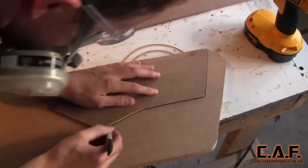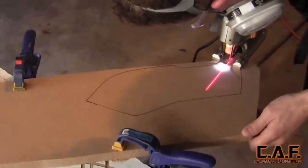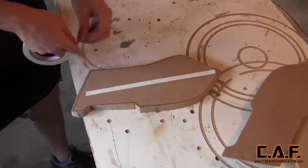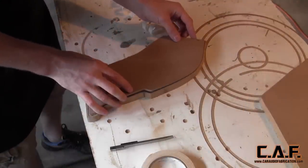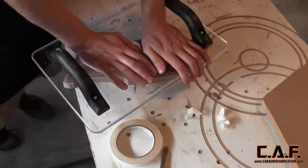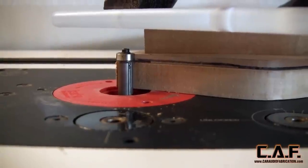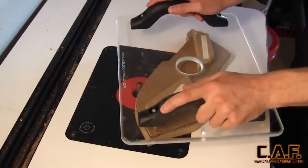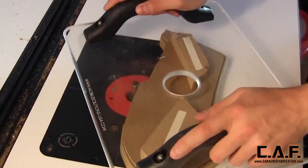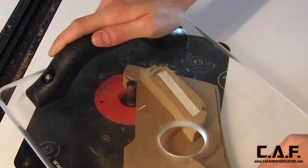I trace around what's left of the quarter inch shape onto a new piece of half inch thick material and rough cut this out as well. I then once again use double-sided template tape in order to stick my two pieces together. This time I'm also going to apply these spacers which will allow me to use a router safety shield. With a two flute flush trim bit loaded into our router table we can now make a copy of the new inside shape. I like to use the Mobile Solutions router safety shield as it allows me to have maximum control over the piece and keep my hand far away from the bit.